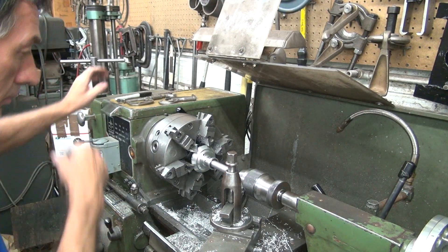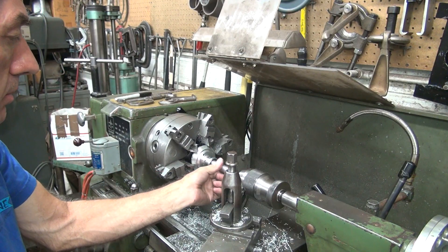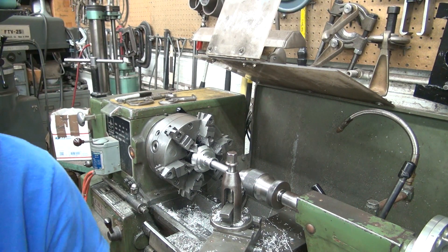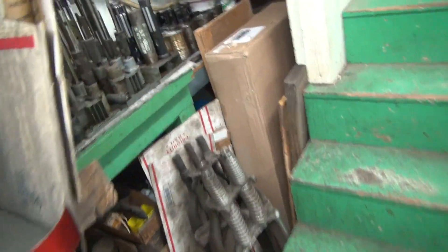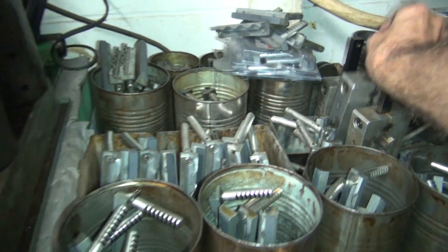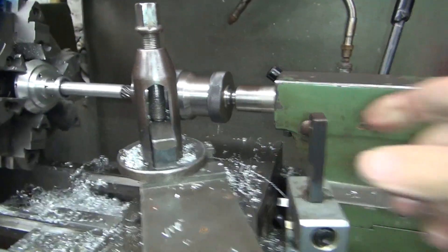Okay, yeah — a couple thou off. That's as good as I'm going to make it. I'll probably have to put a hone on there and hone it a little bit — probably the best way of trying to fix that problem, trying to make a consistent tool that will work for what I need. One of these things right over here — this one right here will work just fine. It's an external hone, so this will make it straight and true and round and give it a good finish. It's a honing process, not sanding or polishing.